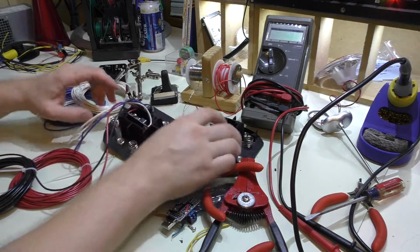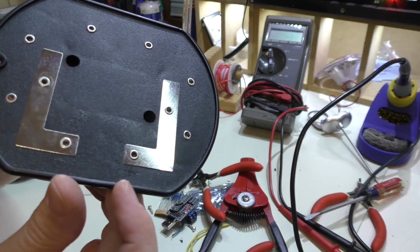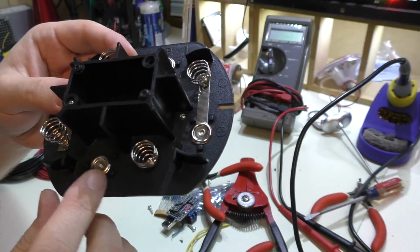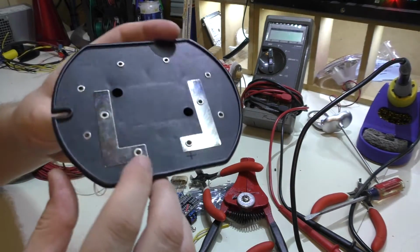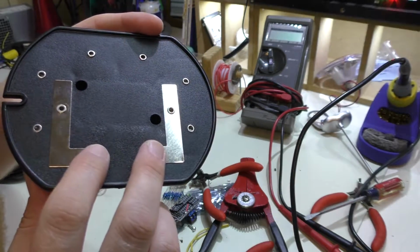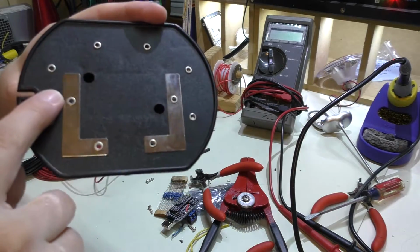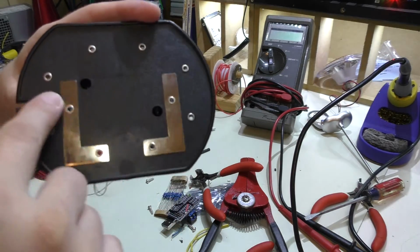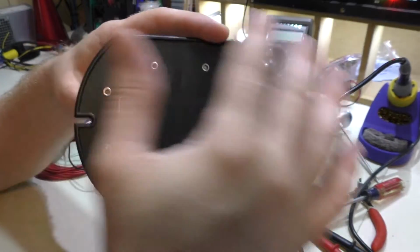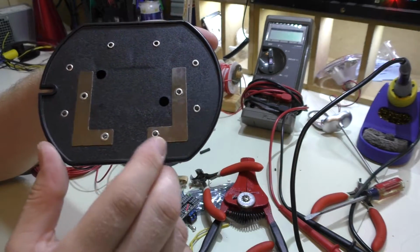And then I looked at it and said, all right, well, the terminals are on the top, and if you look at it, I already kind of inscribed positive and negative over here, and I got that from what's marked over here where the batteries go. And these last terminals are obviously the last connection points, so this is where you're going to get 12 volts from. You can probably connect in other areas if you wanted to tap off and get different voltages, but you would actually drain the batteries inconsistently across all the batteries, and I don't really want to do that. And I'll get into capacities in a minute.